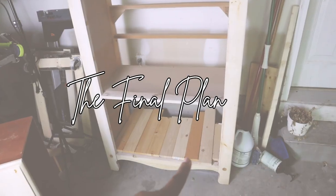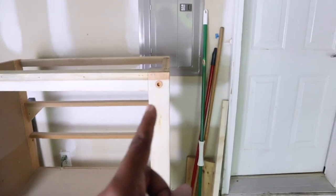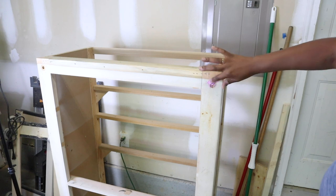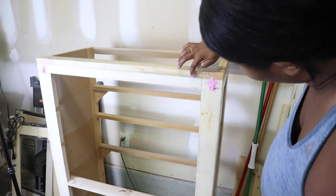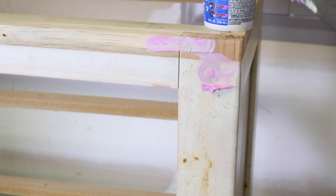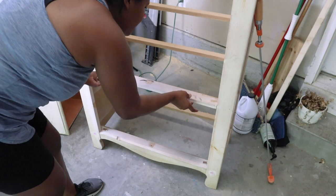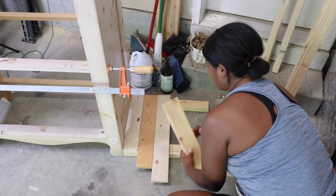The bottom part is going to be planked, the top part is also going to be planked, and on the sides I am going to build out using two-by-twos an area that will house my eight-foot pieces. Before starting all that, I puttied up the areas where the little decorative button hardware had been — I pulled those off a long time ago. I just gunked the putty on to fill the holes, then smoothed it over. I also glued a piece back into place and clamped it to dry.